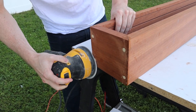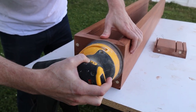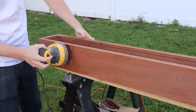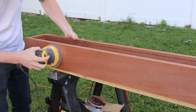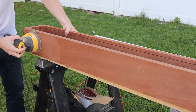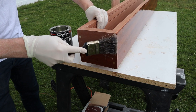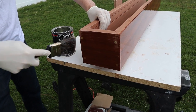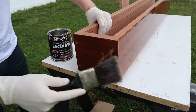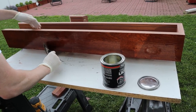At this point the glue from the dowels was fully dry, so I took a sanding pad to it and removed as much as I could until it was flat. I then came back with a lighter grit — I think this is 120 — and smoothed the surface. I did this to all sides, as well as hand-sanded the inside to make sure I didn't get any splinters. I moved up to 220 for the outside to get a nice smooth surface. Then it was ready for some finish, so I took out this can of lacquer, grabbed the crappiest brush, and just soaked this thing in lacquer — about two or three coats. It came out really good.